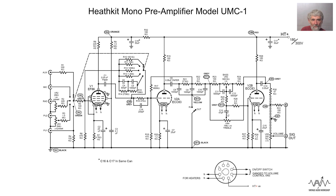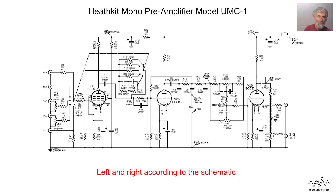Conversely, with the treble control, although there is nothing to stop bass being fed back across the pot - that provides negative feedback at the bass frequencies - this capacitor here blocks all but the treble frequencies from being fed through to the center point and hence to the grid of the valve. So if you turn this to the left, all the treble is fed through with no bass or middle, and you get treble boost. But if you turn it to the right, you get heavy negative feedback from the anode of the valve through to the grid and you get treble cut.